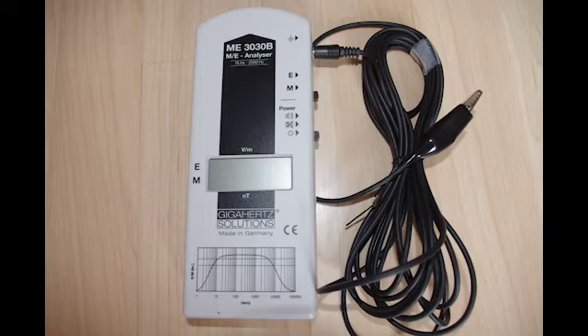Notice how I swept the meter slowly over the area I wanted to measure to take my readings. That's what you need to do when using these EMF meters: sweep slowly, watch the display, and listen to the audio. Ideally you want to do this survey twice a day over three non-consecutive days.